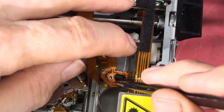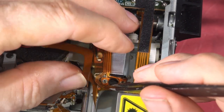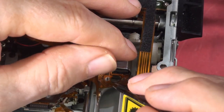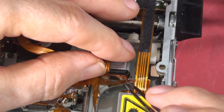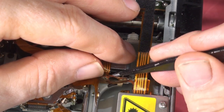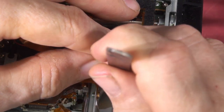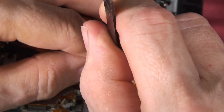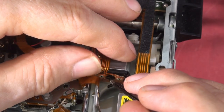She's in there — lovely. Just pull the ribbon over the end gently, make sure you see properly. She's in, just slide the contacts over the end. That one bent slightly in transit, so make sure both contacts are standing perpendicular to the surface of the motor before you put it in — otherwise you'll have to straighten them like I do.